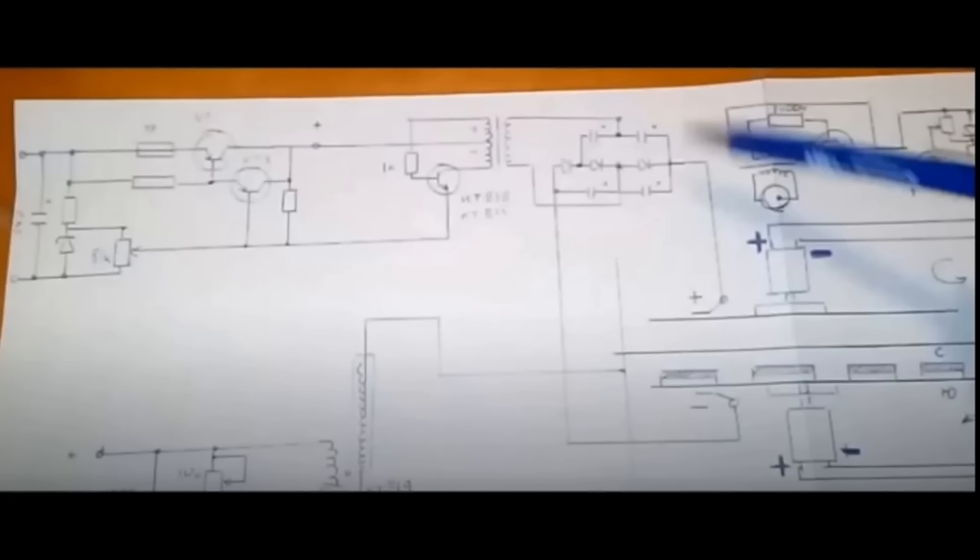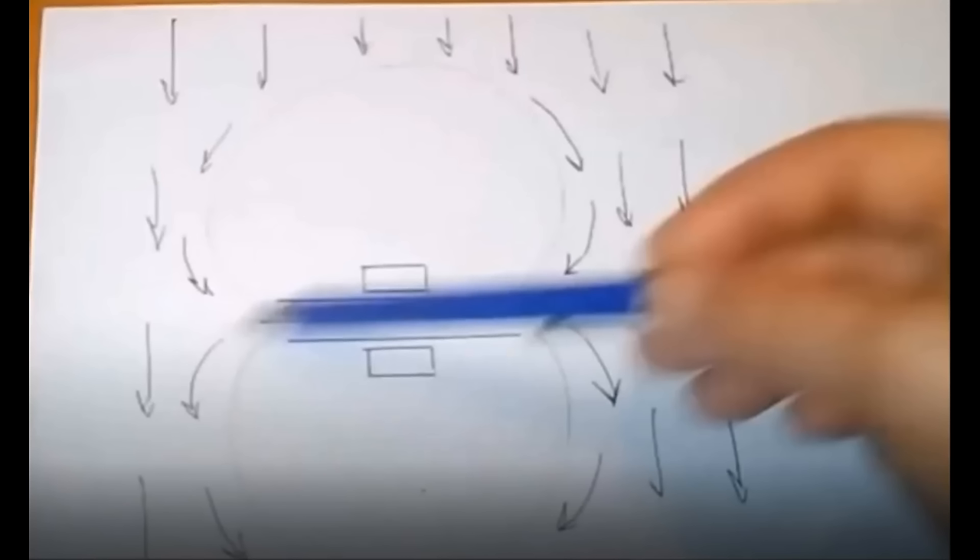The upper right of the schematic is the confusing part — there should be a separate motor driver and also a separate part for the ultrasound device. A lot of people just buy a transducer on Amazon and use the circuit they get with it. That's not the circuit you need. It's a build-up circuit that builds up and then explodes all at once — it's a different circuit altogether. The one from Amazon is basically a run-all-the-time vibration machine, and that's not what this is used for.